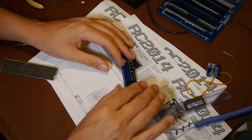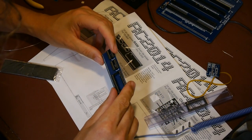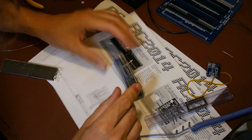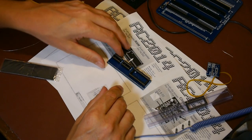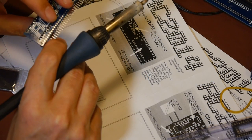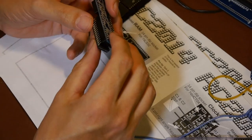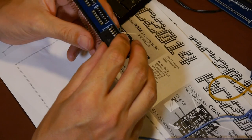Right, so we've got that — and is that it for that board? We could put the chips in. Oh no, we've got to put the header strip in. Oh bugger, I haven't soldered that in very well — that's what you get when you're talking. Let's push that down and have another go. I wish I had a tool for putting IC legs in.